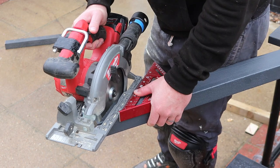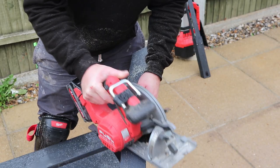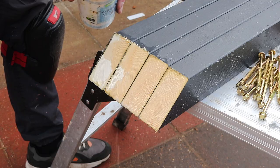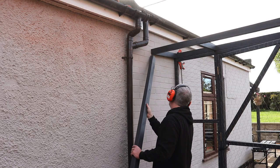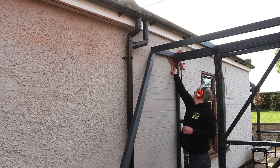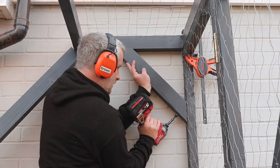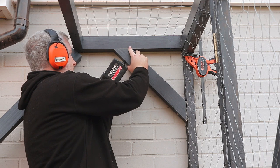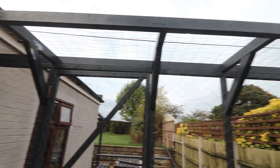I'm cutting some 45-degree angles to give me corner braces, also 550mm in length, and I treat the ends with a couple of coats of preserver. Using a length of 3x2 to lift the roof frame until it's sitting level, I can then secure the support braces with hex head exterior timber screws, adding one for each upright to make the roof frame nice and rigid.